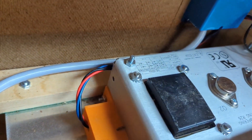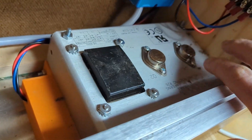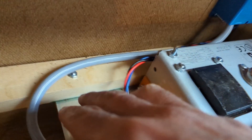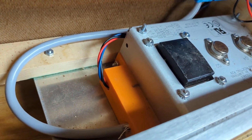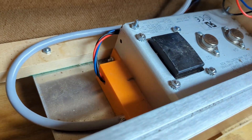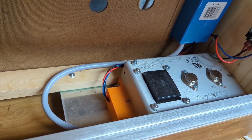Back to the power supply — there are open sides on this chassis, but they're up against the side and front wood of the case. It's attached via these long machine screws to an aluminum sheet at the bottom, and the earth ground is connected to the chassis. So everything running at 120 volts is tucked away inside a grounded enclosure, so it should all be fine and safe.